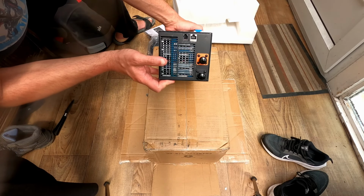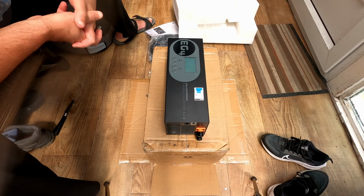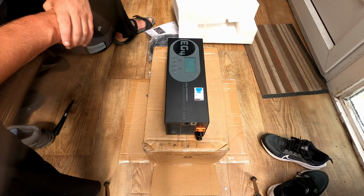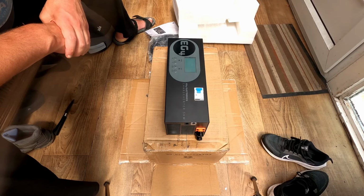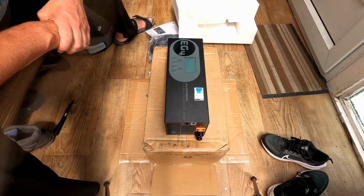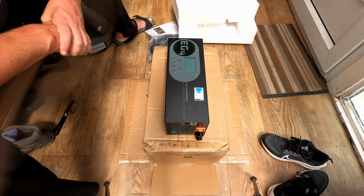And connect it. So the idea is to make sure that the generators are connected to the mains. So there's one connection to the mains of the boat, so that I can use the inverters directly from the generators into the actual mains of the boat, or if I want to use it as generators for charging the battery, I will then connect the load via this Chargeverter box so that I can charge the batteries.